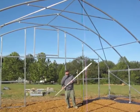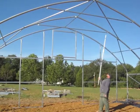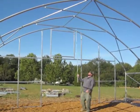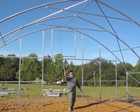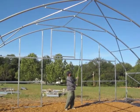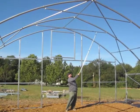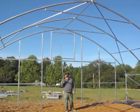The additional bracing in the fixed tunnel also includes the truss kit. This structure has a single-piece collar tie instead — a 12-foot collar tie that was built when we put our hoops in. The end wall does not have that when we have a metal end wall. There are nine hoops in this structure, so there are seven single-piece collar ties inside the structure.